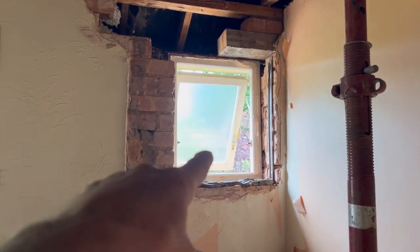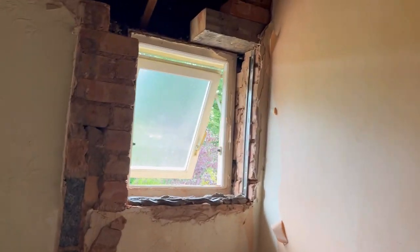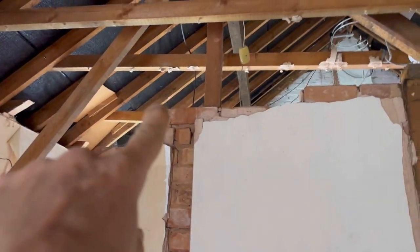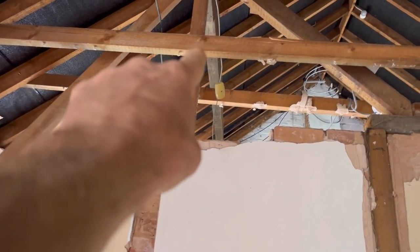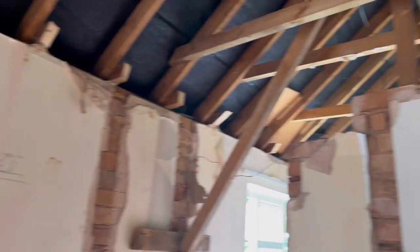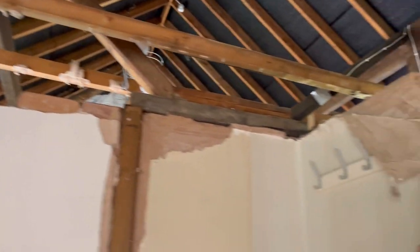So Adam's going to block all that in, put some wall starters on ready, put the plate on. And then, as I said earlier, we'll set that plate on a bit of compo, not a timber packer. Put a compo on that there, set that, and go around and just laser them all using my laser. That's the plan.